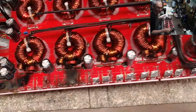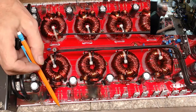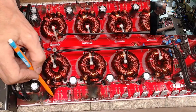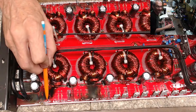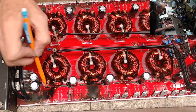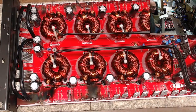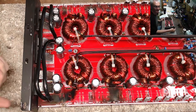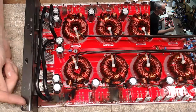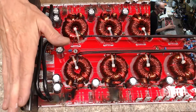These transistors are clipped pretty hard to the heat sink. If you have a solid object here and a moving object down here, the only three things you have are these tiny TO-220 transistor legs sticking out of the board — and then they break off flush right at the board. So vibration, guys — tighten up these screws, make sure they're tight. If they're stripped out, take them out and put longer ones in to grab more of that heat sink, just make sure this end plate is tight.